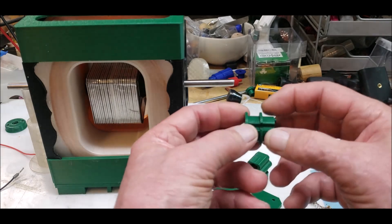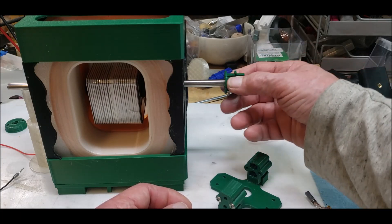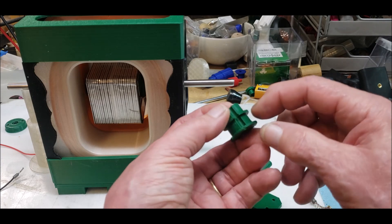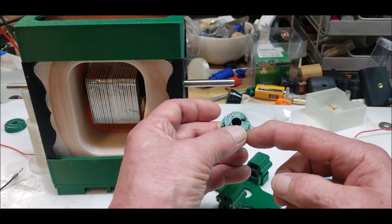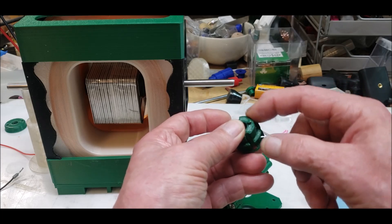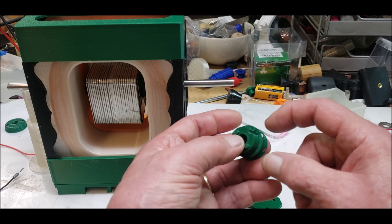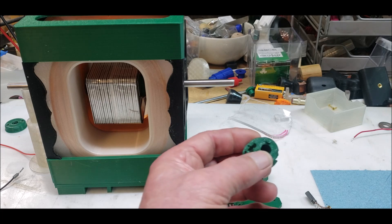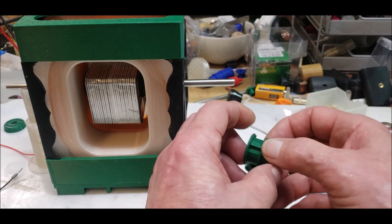This is one of two commutator pieces that go on like that. I have very thin copper sheeting that I can cut and put around one of the hemispheres — one of the slats here. I'm not sure why he put these grooves in here; I'm sure if I look at the picture I could see.